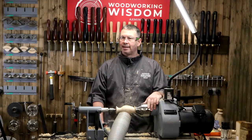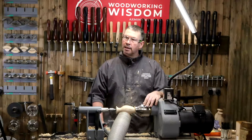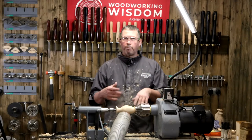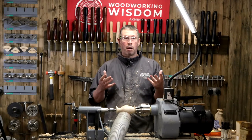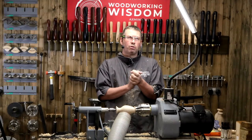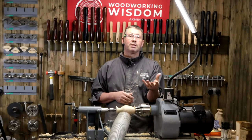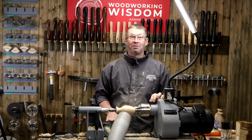A question from Fuller. Speaking of spalting, can spalted wood be stabilized by instilling a wood hardener under pressure? Yeah, absolutely. You'll see a lot of stabilized pen blanks, for instance, that you can buy, and very soft punky timbers that normally you wouldn't be able to turn. By using vacuum, you can suck in that resin. Things like cactus juice, that's the sort of resin they would use to stabilize pens and softer materials, right down to things like corn cobs. Dry corn cobs that once dry and dyed look like snake skin. So really interesting way of stabilizing work.